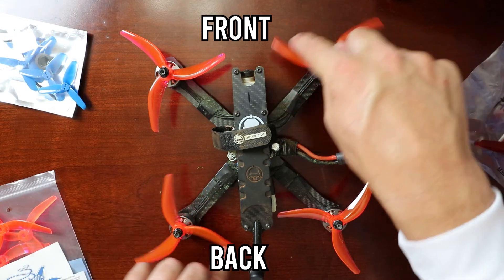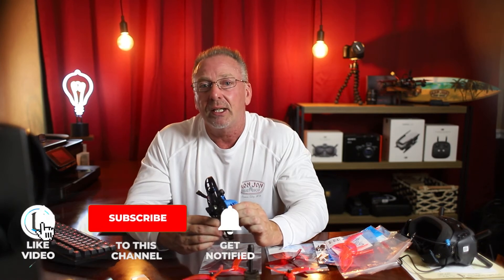I hope this helps a few of you out. As many of us are relatively new to the FPV hobby, getting the props mounted correctly is probably the biggest mistake many of us are making — including myself — when we're getting started, and I've done it a couple of times already. I'll be doing more FPV tutorials and videos in the near future so I hope you'll stick around and subscribe. I'm just waiting on an XT30 charging cable for my new Beta FPV 95X quad. I'd love to hear from you if you've ever installed your props wrong — it would make me feel a whole lot better knowing I'm not the only one. I think it's because I've always been flying DJI props, which have very distinct markings for the counterclockwise and clockwise props with the little white markings on them.